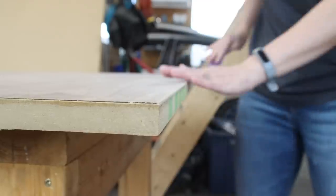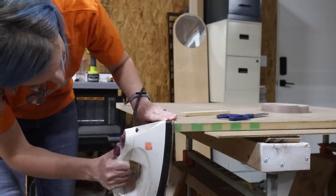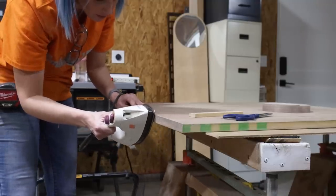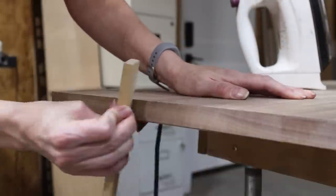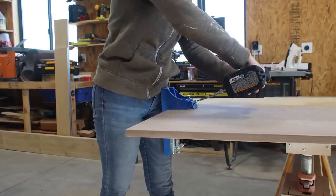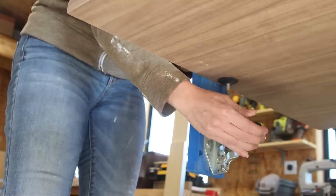I very lightly sanded the edges of the panels and then it was time to apply edge banding. There are different types of edge banding, but I definitely prefer the type that comes with adhesive and can be applied with a household iron. They do make special irons for applying edge banding, but honestly a household clothing iron works just fine. I decided to buy a used clothing iron from a thrift shop for just a few dollars. Once my edge banding was applied, it was time to prepare the panels for joinery. Pocket hole joinery gets a bad rap from a lot of old-school woodworkers, and they're not perfect for every project, but in this case pocket holes are exactly what I needed to join the larger vertical panel to the horizontal panel of the surround. Pocket holes are a really fast and easy way to create a 90-degree joint where you can hide the fasteners.